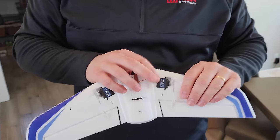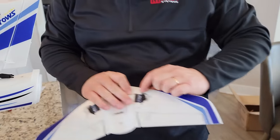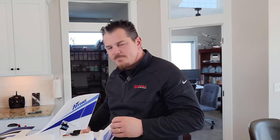If it's going the wrong way, you take this whole servo out and unscrew the four screws on the bottom. The whole assembly slides apart like this, and keep all the gears where they go. You're gonna desolder two of the three lines going to the trim pot and switch them. Doesn't matter which two you switch, okay? Once they're switched, switch the polarity on the motor backward. You are using a reverse servo now. You can do that on almost any servo. That's how you reverse a servo.